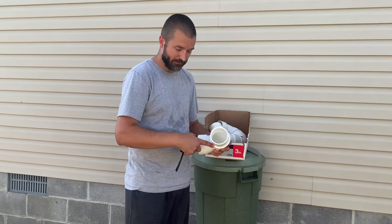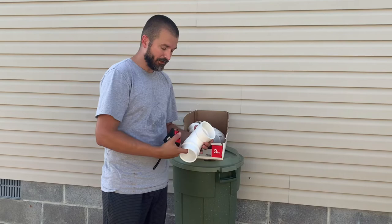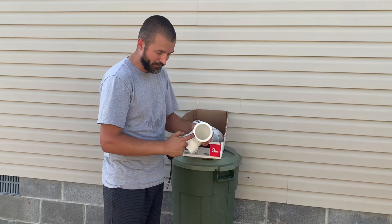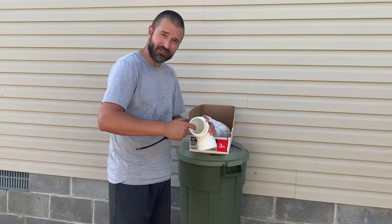The street elbow has this natural lip right here, which is perfect for making the connection. As seen in the other video, I cut off the large end with a jigsaw flush - that's the end that goes inside the garbage can. The small end with the natural lip will go on the inside and come out, and the four inch piece you cut off will fit over the three and a half inches nice and snug. Because of this lip, there are almost no water issues.